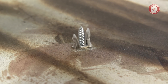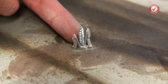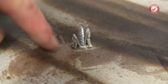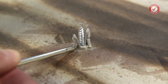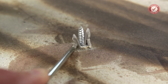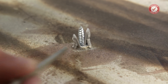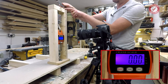Excuse the state of the drywall, it's just some spare stuff I had knocking about. But you can see the way these work — basically when the screw comes up through the fitting it forces the legs apart, and then those little sideways cleats catch on the plasterboard as the fitting tries to pull itself out. There's also a certain amount of friction fitting around the base of the fitting as well. Let's give it a try.